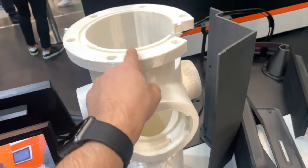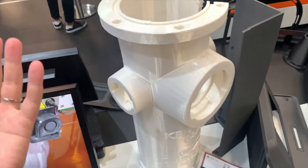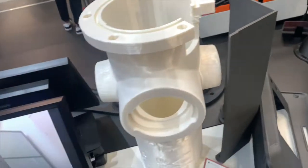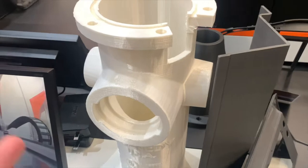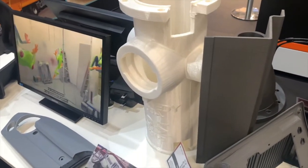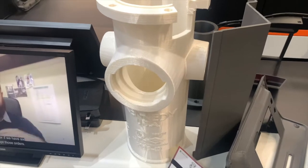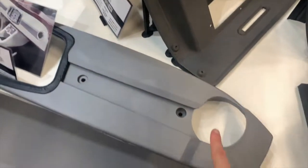Kennedy Valve bought the printer not primarily for prototyping — that was a secondary benefit. They can print hydrant prototypes in PLX, paint them to look real, and transport them around trade shows without weight issues. They can also print cut sections to show internal details. But the real reason they bought the machine is sand casting — printing one cubic meter of patterns, core boxes, and loose parts. This is hugely changing the industry. On November 30th we'll go live with a webinar with METS, showing how they use the Pro in Brazil and the BigRep 1 to improve core box and loose part production for sand casting.